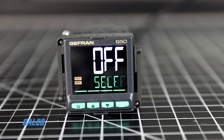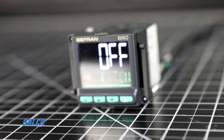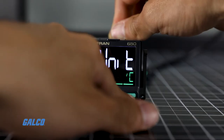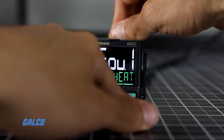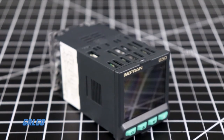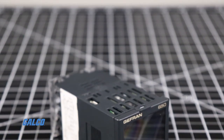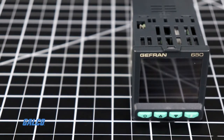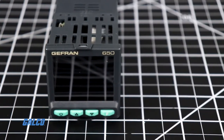The 650 series controllers are also great for preventative maintenance with switching counts and alarm thresholds that notify users of worn actuators. This control also has a built-in energy counter that looks for abnormal energy variations and monitors total energy consumption.